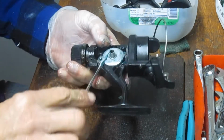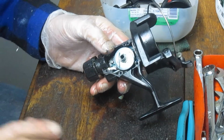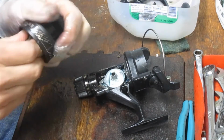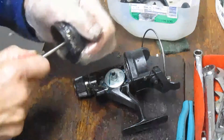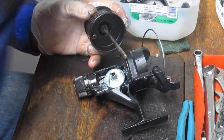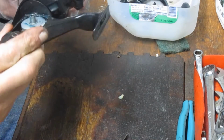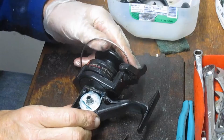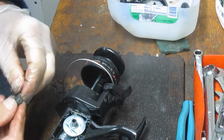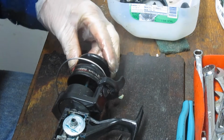Put a little bit of grease on the top of the main gear. Not much of that is required, and also onto the side of the shaft there. I did notice we had a little bit of gunk and stuff on the main shaft as I took it out, so let's just clean that off. Again, it's more evidence that it's just been sitting. Bring that back. We can bring that through. This is a D-tube. Now you're looking for the, oops, need the crosswind block in there. Crosswind block rides on the stud, and we can bring it down, bring it through.